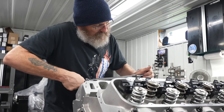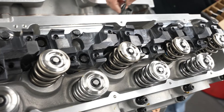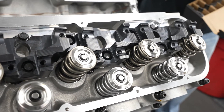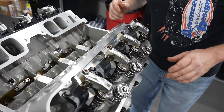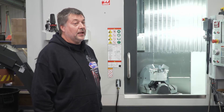In the five-axis machining world, that part is able to be produced with one hit of the cycle start button. In a three-axis application, that part would be well over a five-hour part. In a five-axis application on this style UMC, you're looking at a 45-minute cycle time.